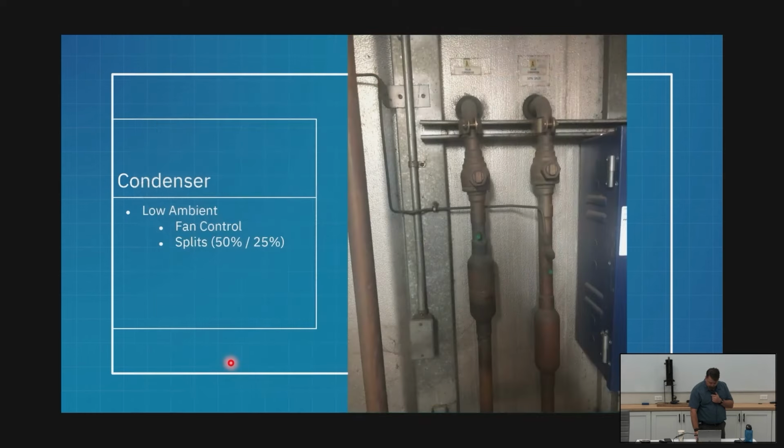All right, what about the other end? So I've got my hot gas coming up to my condenser. I turn off a solenoid so I don't flow refrigerant through it. But those two pipes come back together, so it's to keep that refrigerant from coming back into my condenser. Checking valve. Got to have a check valve.